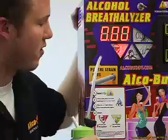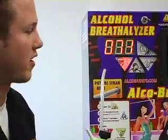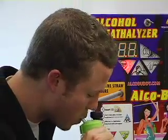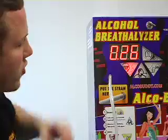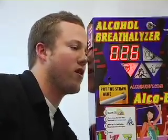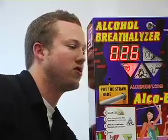We will wait for the next countdown and then give a nice thorough blow for a few seconds. As you can see, 10 seconds is counting down, so I am going to get ready to blow into the machine. It came up 0.26, so it is a little low. I am going to adjust the screw clockwise about half a revolution and we will see if that does it.